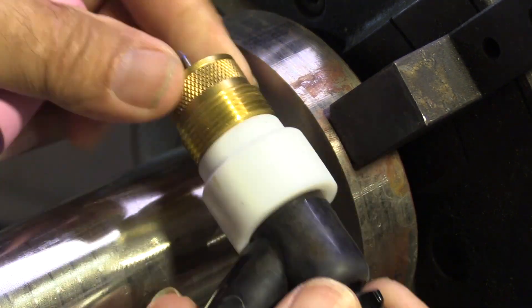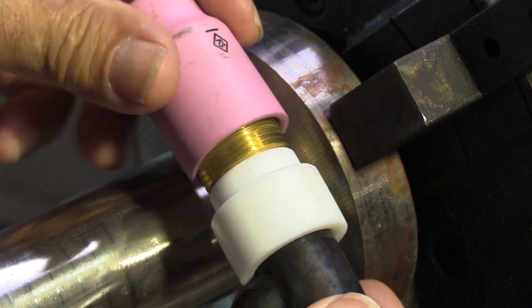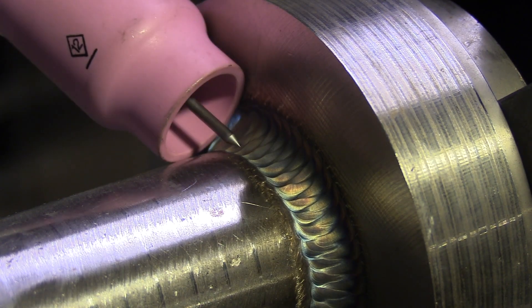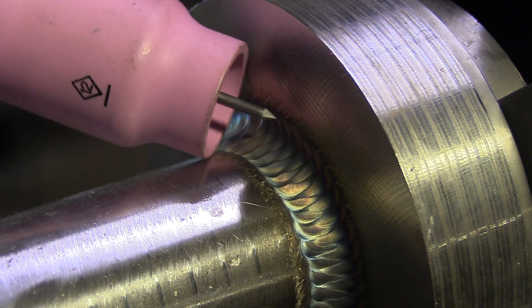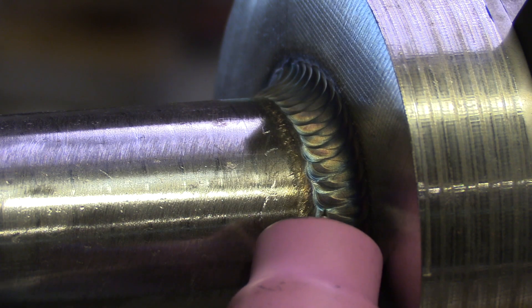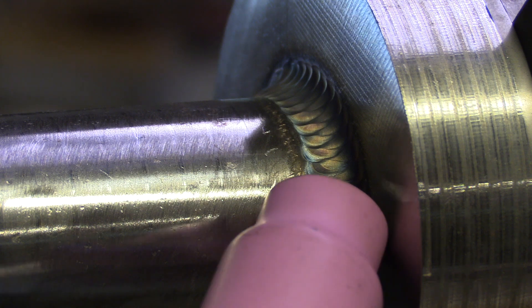This is the way that goes on there — not hard at all to swap out. That number 12 is going to let me extend the electrode out a good five-eighths to three-quarters of an inch no problem, and I'll just weave a nice wide one in over top of that and then start stacking them in there.